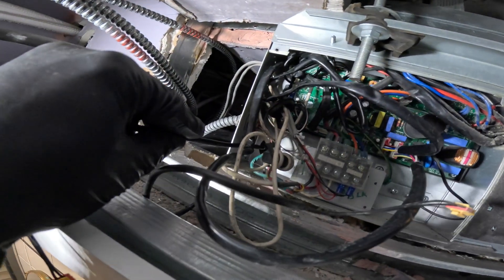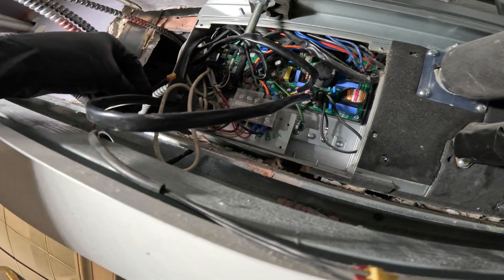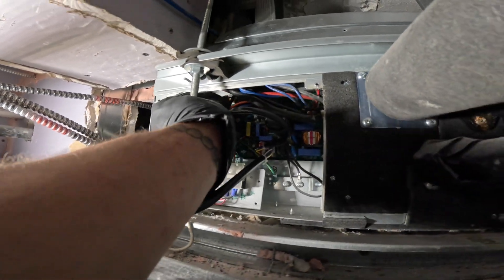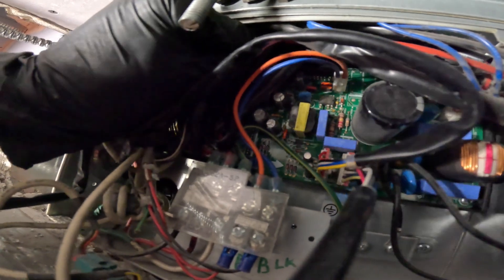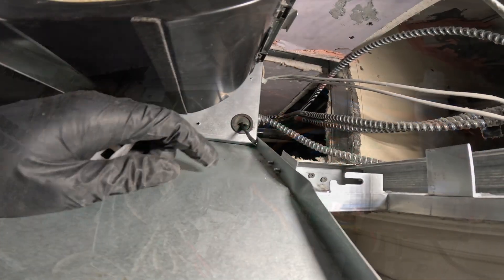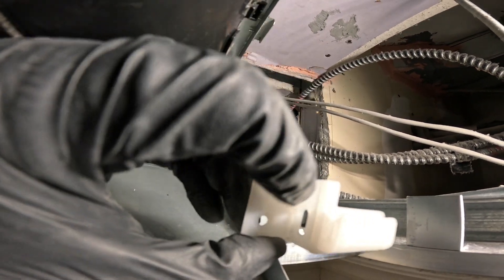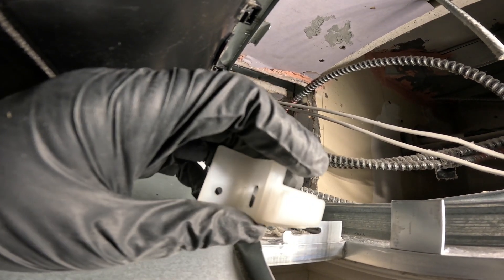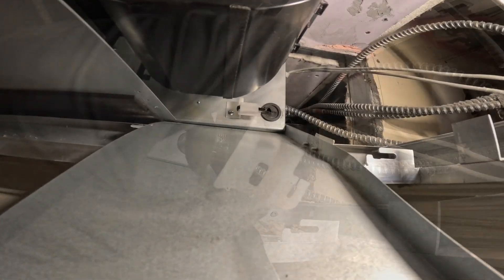Here's the new sensor. We're going to push it through that hole right there where there's a rubber grommet and snake it through. Back inside here — it's really tight. Push it in, and that's in the little yellow connector right there. So back on this side, we're going to fit it back onto this clip. We'll run it through this hole, pull it out, and tuck it into here. Just put it back the way you found it. And it's in.